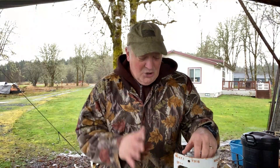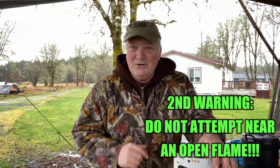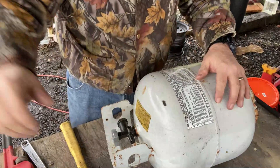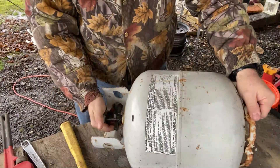Now, obviously this has been open for a long time. Don't just start pulling this valve off without checking to make sure that the tank is empty. Open the valve, shake it — if you hear anything sloshing around in there, don't start opening up this valve because there'll be a lot of pressure under there. That is my first warning. Make sure you abide by that because that could cause serious injury if not death. Make absolutely sure there's no gas in it.